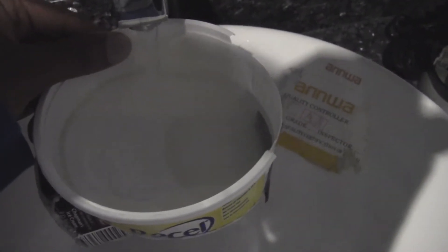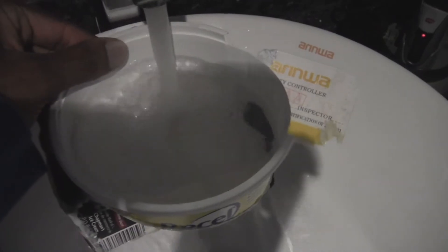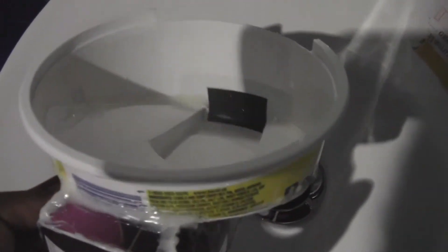Maybe I have to turn up the water. We need a lot more pressure. The good news is that it's not leaking. The bad news is it's not pulling out the water. It just goes back to its default level no matter how much water I pour in. I don't think the trap way is long enough, or maybe it's out of proportion in size — that's why it doesn't pull out all the water to actually flush.